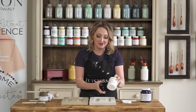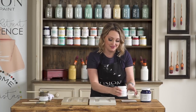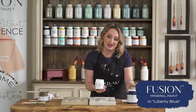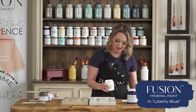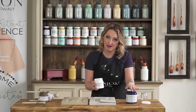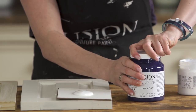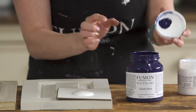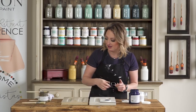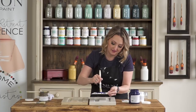Now on to our next one — we have a clear glaze. With the clear glaze you can actually customize any color that you want. We're going to go a little bold here just for demonstration purposes. We're going to take the clear glaze and mix in a little bit of Liberty Blue and do a blue glaze over top of this cabinet. You want about three parts glaze to one part paint, and you can play with this — you can make it more transparent by adding more clear glaze or more opaque by adding more of the paint. You could use a metallic or any of the Fusion colors.